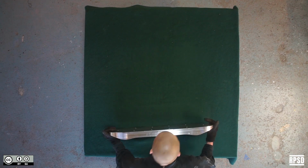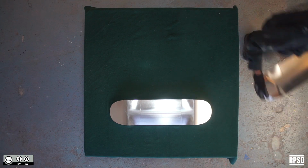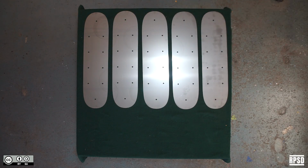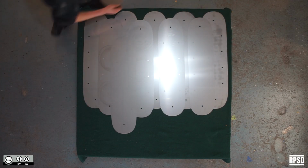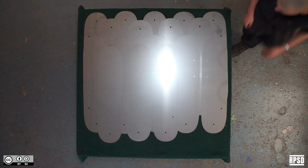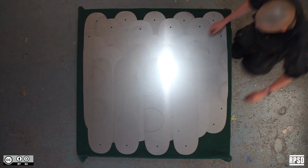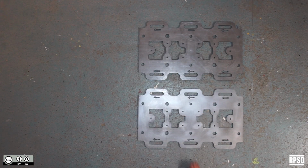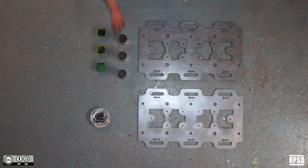You're going to need two CNC cut aluminium blocks, which will form the top and bottom faces of the decks. Some 0.5mm stainless steel washer plates. We ordered 1.5 times the quantity from the 3D model. 10mm laser cut steel sheets. M5 by 10mm dowel pins. M10 by 16mm countersunk bolts, M10 by 30mm countersunk bolts, flat M20 nuts, heat-resistant paint, and some safety stickers.